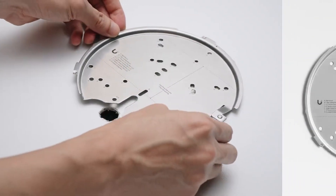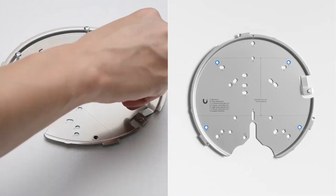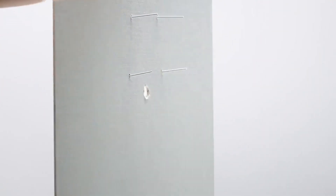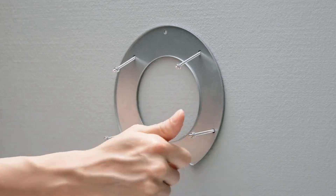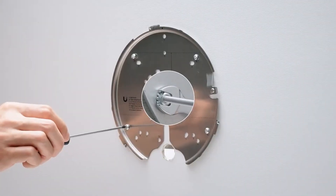Take the attachment plate and line it up to those four drilled holes — these should line up with the A-labeled holes. Place the four M3 screws into the plate and drilled holes. Flip the tile around and place the second attachment plate onto the screws. Use the four bolts to tighten the plates together onto the ceiling tile, using a Phillips screwdriver to hold down the screws while tightening the bolts with a small wrench.